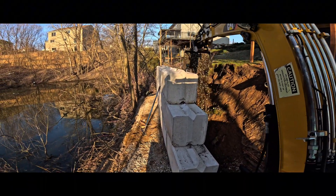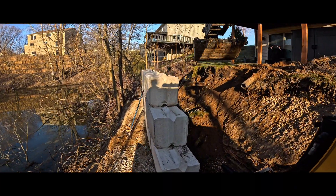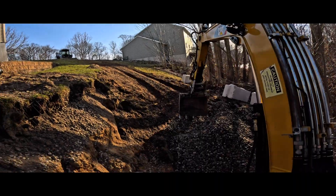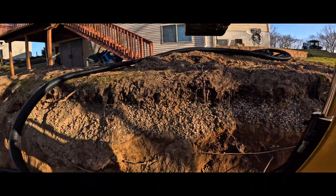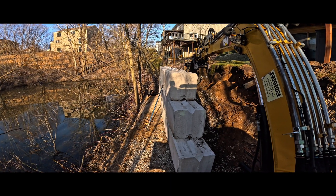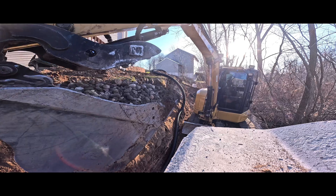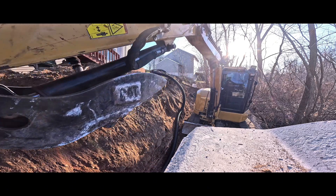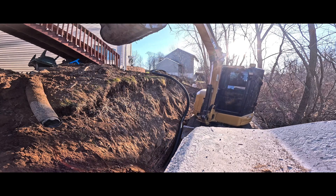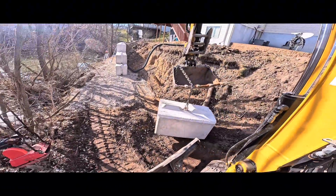Alright guys, for the base of these retaining walls, the material we use is 21 double A crushed concrete. This is pretty much inch and an eighth or inch and a quarter minus, it has a bunch of fines in it. We typically like to go 8 to 12 inches thick and then we compact the base. We use a laser level to shoot grade all the way across the area where we're building the wall — that helps everything be super stable for a long-lasting retaining wall. Behind it we typically use three-quarter inch crushed natural stone for the drainage, and we install a corrugated drain tile depending on the situation. A lot of times we will use geo grid, but on this one we're just trying to save the customer as much money for building a long-lasting retaining wall to hold up their yard.